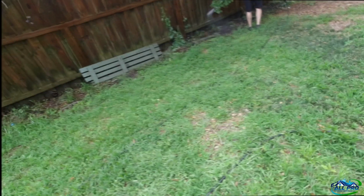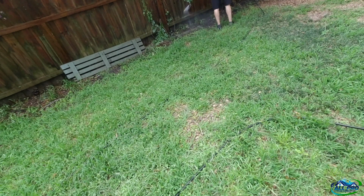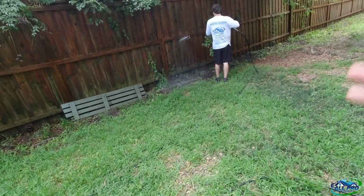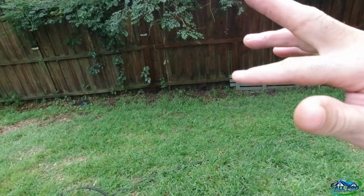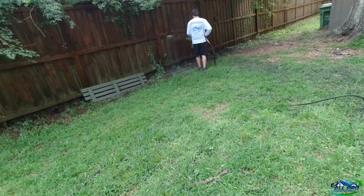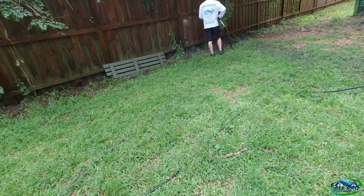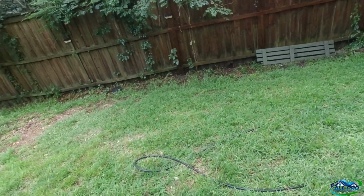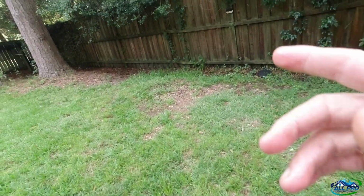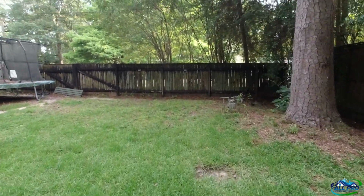All right, guys and girls, still using that 4 GPM unit. Water's holding steady at about 50 gallons. We're taking turns. I'm catching the top. He's catching the bottom on about 4 sections. Rotate, rotate, rotate. That way we don't wear each other out. We're using a J-rod, high pressure J-rod tip. So it's working good. It's coming nice. Getting what we can. We've got vegetation here, so we're going to work around it. We've got this little section left to do, and we're out of here.